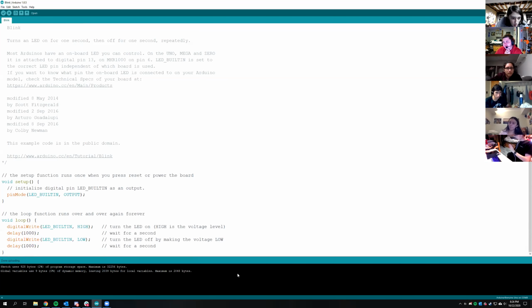So try resetting your board. Just press the button on it, and then try uploading again. Yeah, it says problem uploading to board. Okay, let me try on the other COM channel too. You can also check what COM channel it is if you unplug it and plug it back in, and you should see a new port pop up.